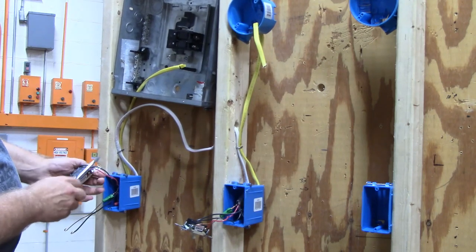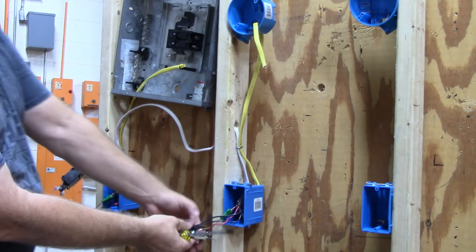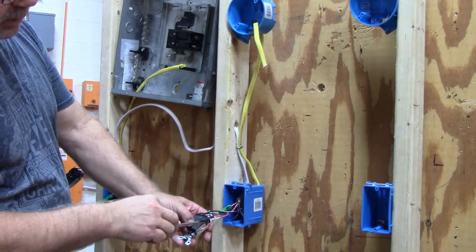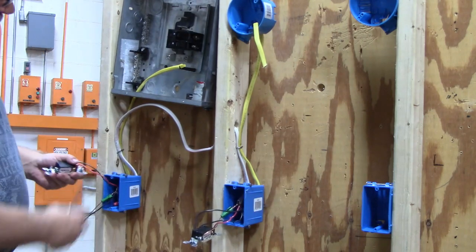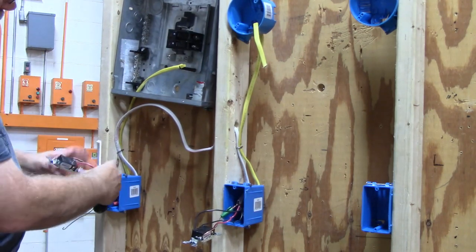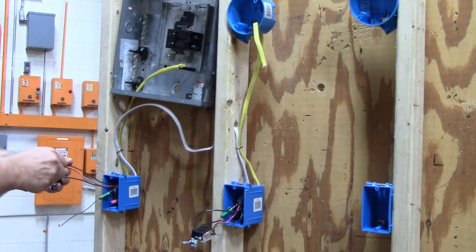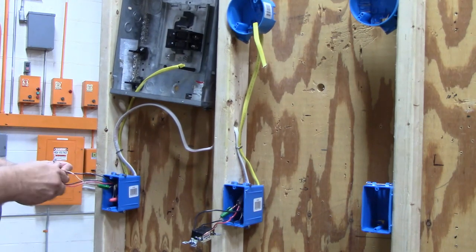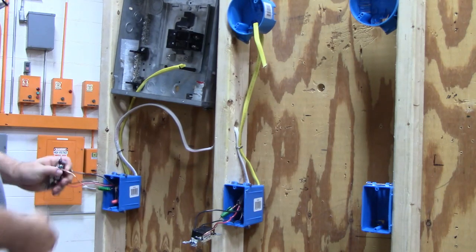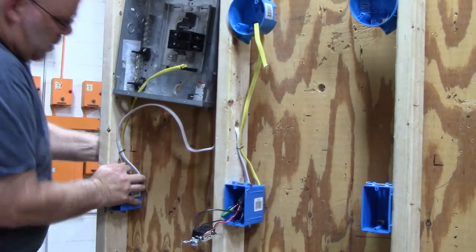So they're across from each other — the red is on the side by itself, and its black is straight across from it. The red is on the lug by itself and its black is across from it. That's the only way this will work properly. Then take your power wire and hook it to the third screw — the black screw in this case. Hook that and your ground, then fold the wires and stuff them into the box.